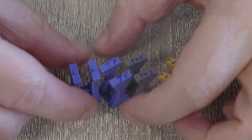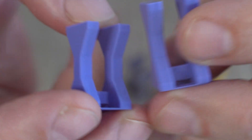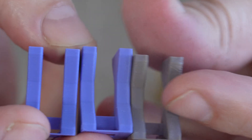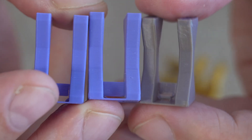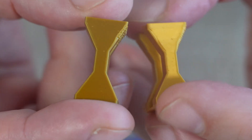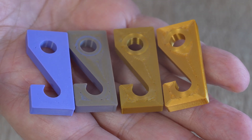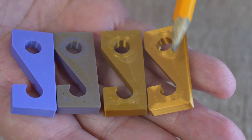Test objects for the layer adhesion. This one is printed from tough PLA filament itself, and this one from silk filament — outside they look completely equal. Now this is the core: tough outside and silk inside. We can see quite a big difference in color. Interestingly, the silk filament and the core version look very similar, which means the color of the silk is stronger compared to the tough PLA. And these are hooks — all from 3D printed filaments: pure tough, tough outside with silk inside, silk outside with tough inside, and pure silk.